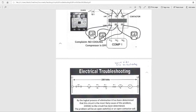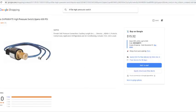It's not going to let refrigerant flow through. Well, not refrigerant, I keep saying that, but it's the same concept pretty much. Water, electricity, anything, you can kind of use these schematics. That's how I learned anyway. I used to always say, think of water flowing through, more like a bridge or a pipe. If a car is driving over a bridge and they open up the bridge, the car cannot get through there. So I just wanted to show you what a high pressure switch and a low pressure switch are.